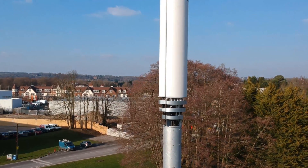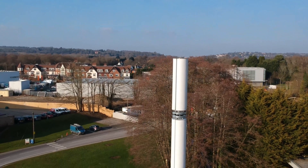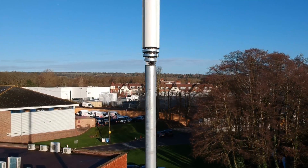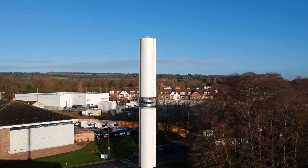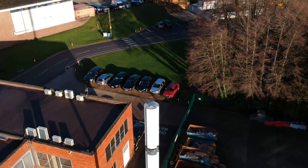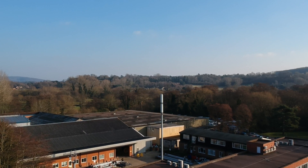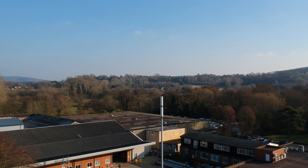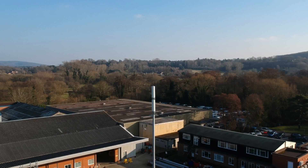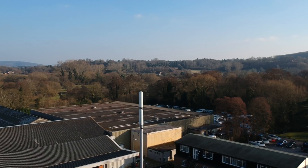Now for the fun bit — the antennas. This street pole has 6 specially designed 8-port RZVV65BR4 antennas, each with 2 low band ports that operate between 694 and 960 megahertz, 4 ultra wide band ports that operate between 1695 and 2690 megahertz, and then 2 ultra wide band ports that go all the way down to support the supplementary downlink band — so 1427 to 2690 megahertz.